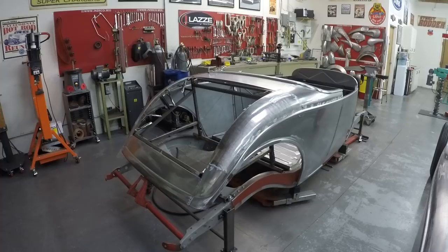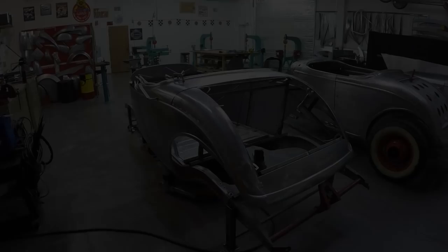If you're building a car for yourself, make sure it is straight from front to back. Cross-measure it and make sure everything is up to the right specifications, because a twisted body — you can never do anything to it.